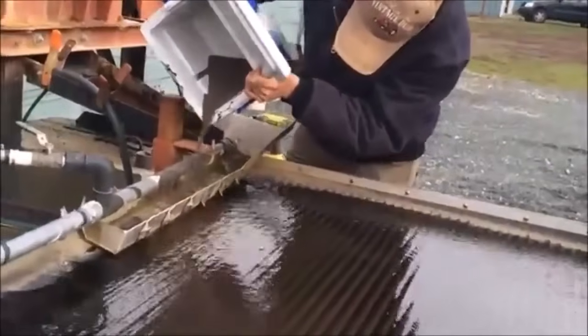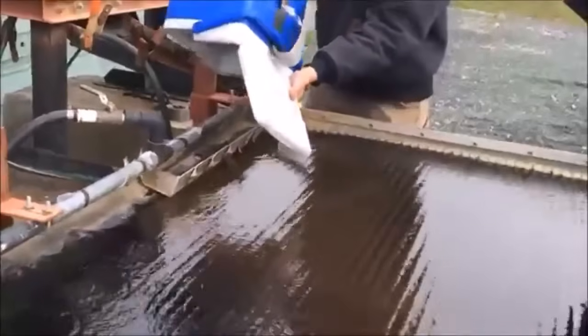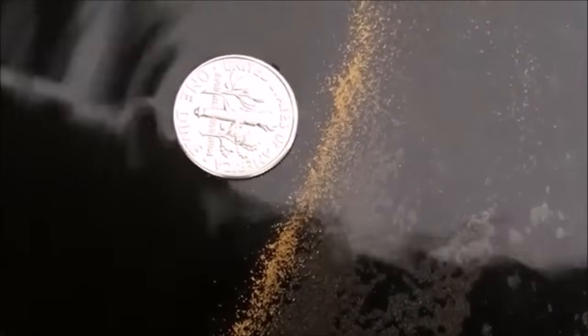This fellow brought down 30 pounds of material we're running across the shaker table. There's some very fine gold in here, but some of it is probably as big as 12 or 16 mesh flakes that the miners missed, and then there's a lot of very fine gold as well that most gravity recovery devices will not catch. You can see how fine some of that fine gold is right next to a dime. The red material — that's the garnet he's been fighting. It's amazing how the table separates that, because when you're panning it's really hard to get out.